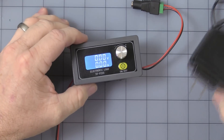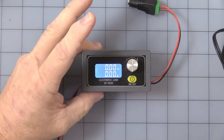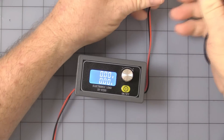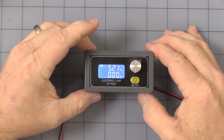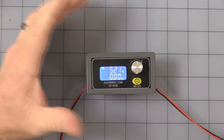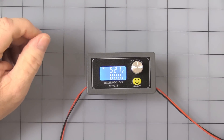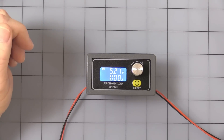I'm going to use a plug transformer to demo it today. That way it'll stay a nice constant source instead of battery drain. What's also good about this is it shows you that not all plug transformers are created the same. This is a 5 volt 4 amp plug transformer, but as you can see, with no load it's at 5.21 volts. So this will be a good way to test these plug transformers and hopefully cut out problems with your projects.